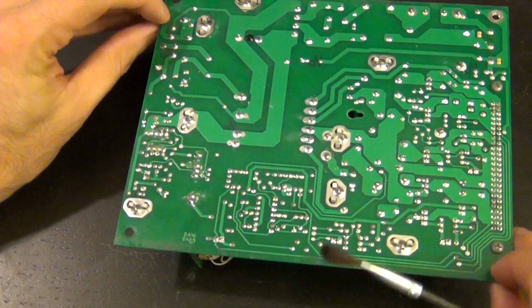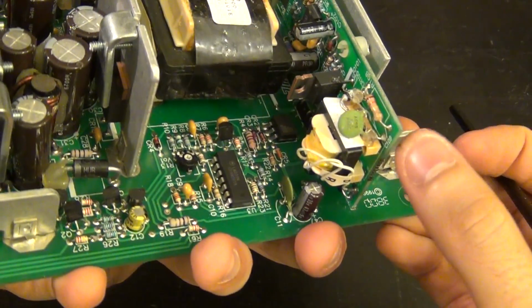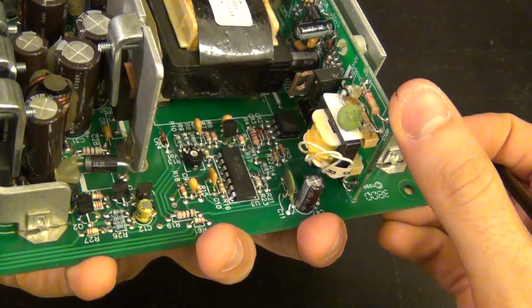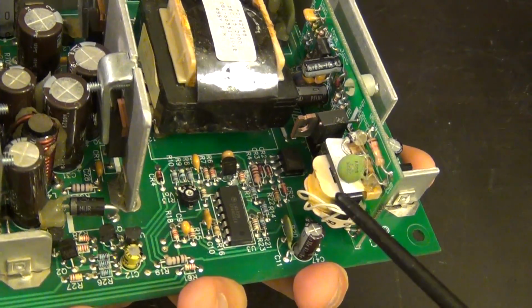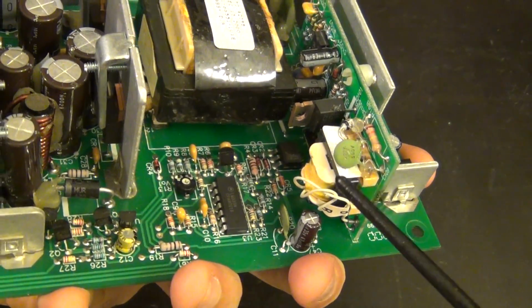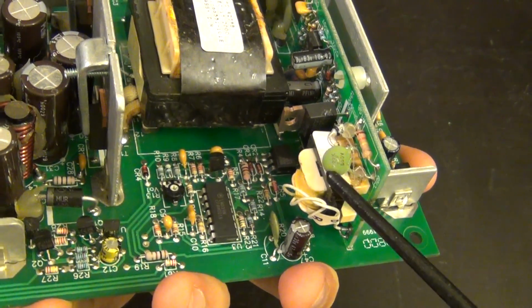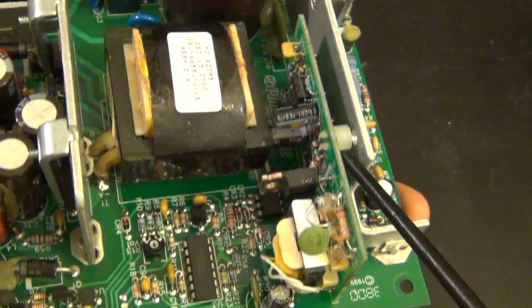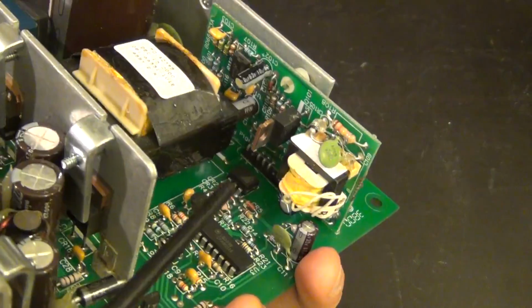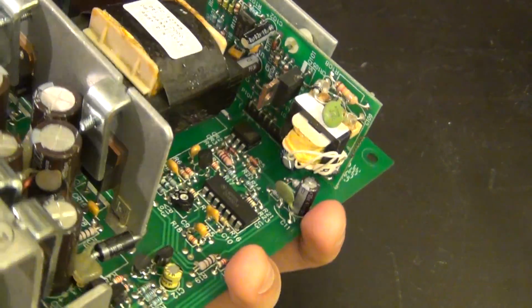And look at that. What is that? That is this board. Aha. This board right here seems to be the board that is generating our standby voltage. So now we have a definitive place to investigate. It has its own coil, its own transformer for its own DC-DC converter, and its own MOSFET. It's entirely self-contained, and it only connects to the main board via very few points.